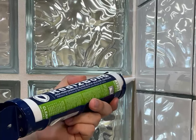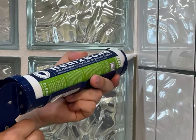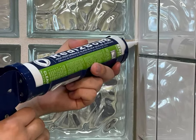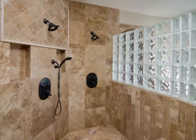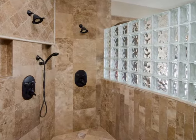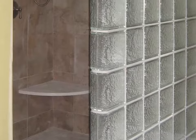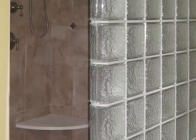On both sides of your glass block project, use glass block silicone sealant to fill the outside perimeter joints of the panel. If your glass block project will be used as a shower or other wet wall, wait approximately one week and seal the mortar joints on both sides of the project with tile grout sealer. Re-seal the joints every two to three years.